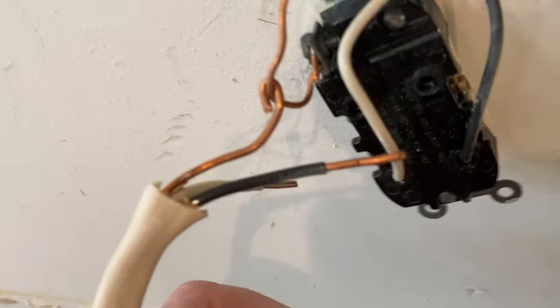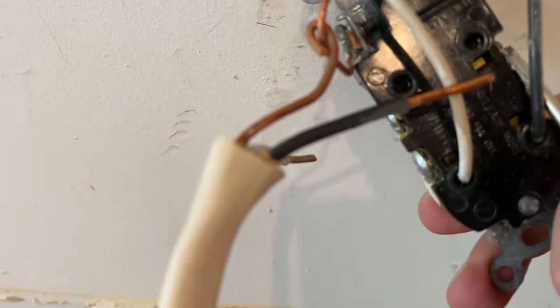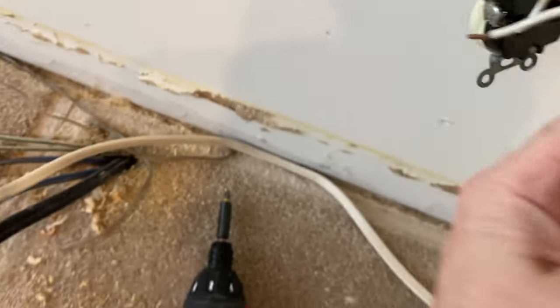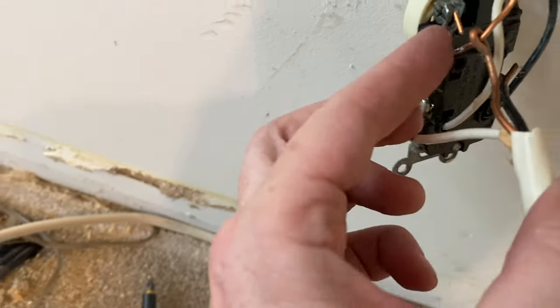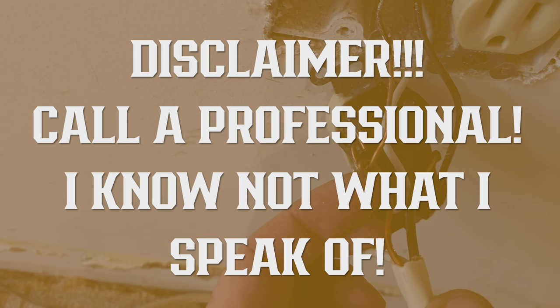You can see that little tab in there — get a little screwdriver, put it in there, push in and pull on that wire at the same time and they pop right out. By the way, on this ground wire — that's a great splice job right there, very talented. Now remember, I am not a licensed electrician — please call a professional.